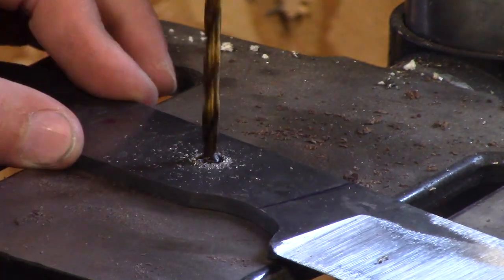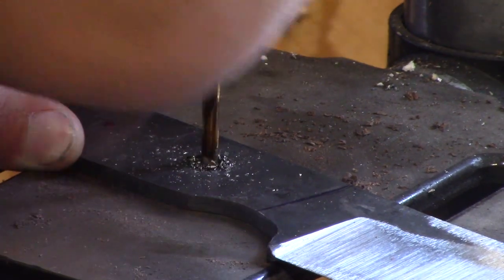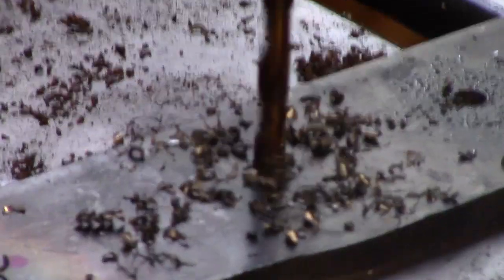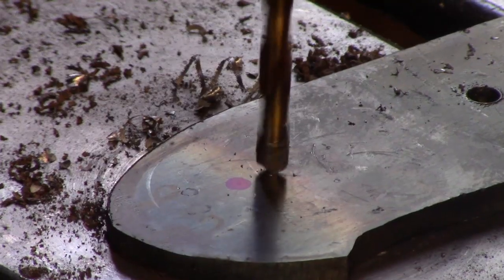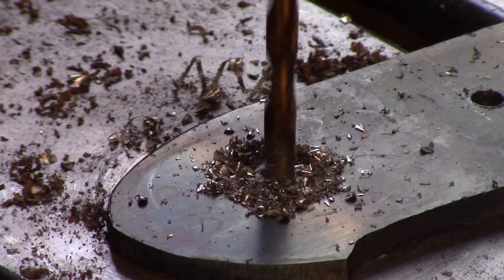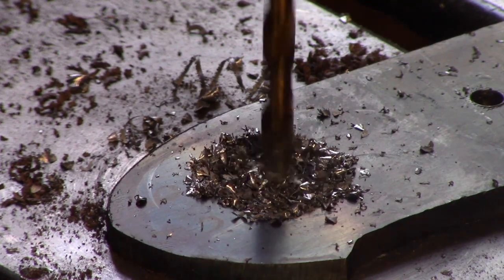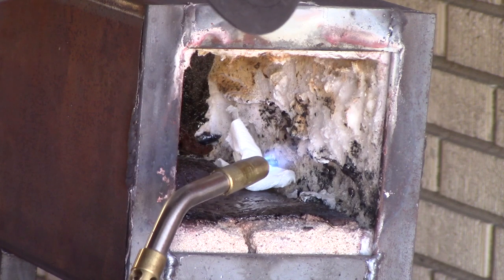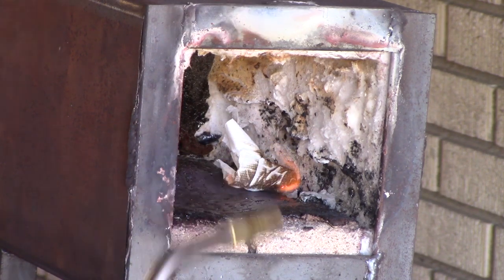So then I went and drilled my main pin holes. These work a lot easier if you start on a slow speed — I use the slowest speed that I can. It takes a little bit of time but it works pretty well. You just add a little bit of motor oil to help cool it down.